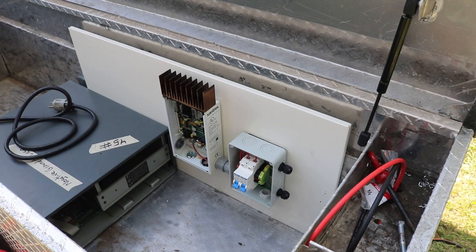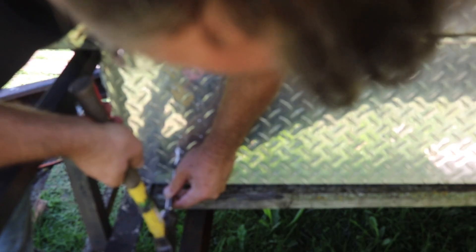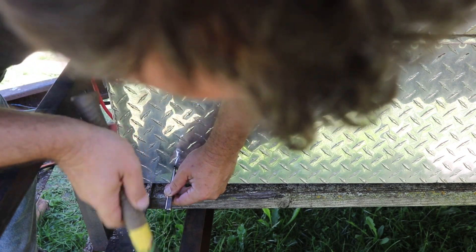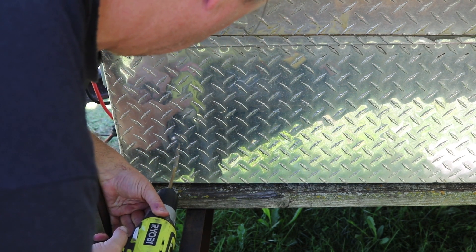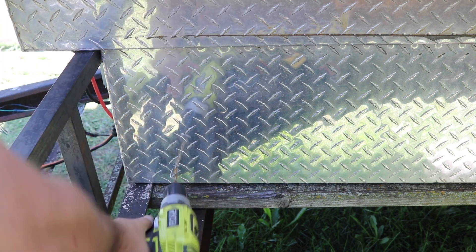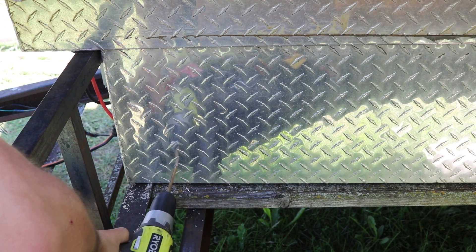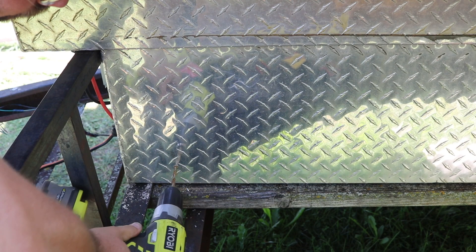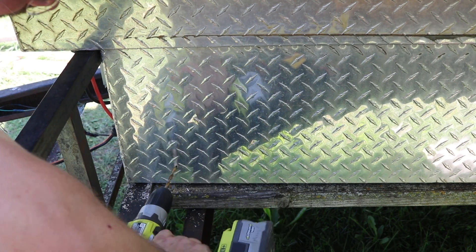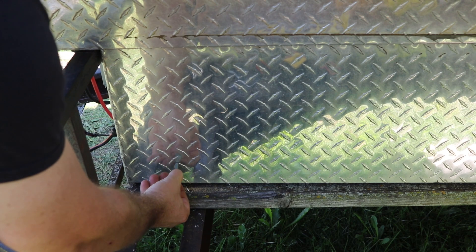Here's the disconnect and the solar charge controller hooked up to the board and set in place approximately where I want them. To permanently hold it in place I have to put some bolts through here, so I marked out the corners — avoiding the components — and put marks on the outside of the toolbox, marked them with a punch, and drilled the holes. I originally tried using a carriage bolt but that didn't work well with the aluminum, so I went with plain stainless steel hex head bolts with rubber washers on them, which worked very well.